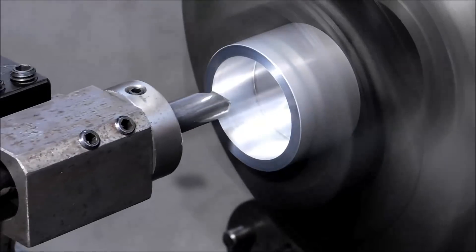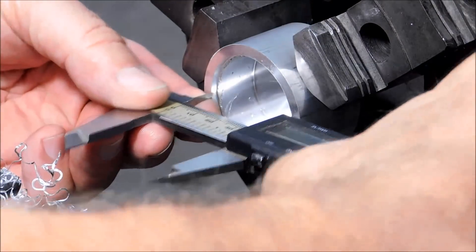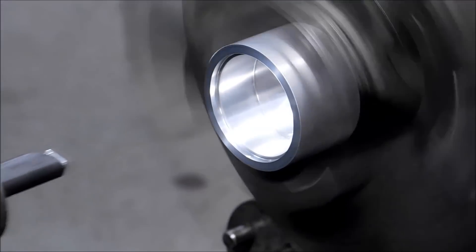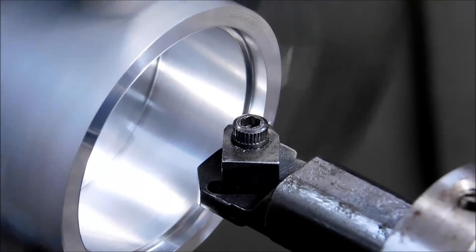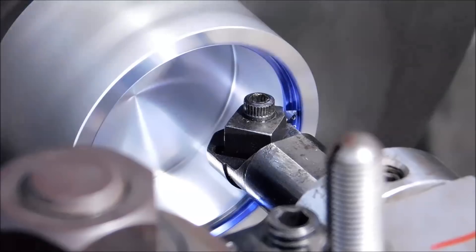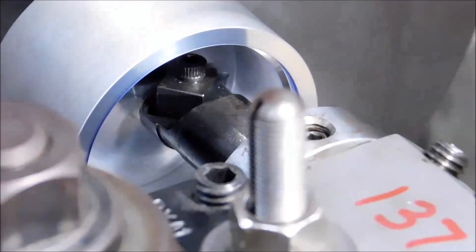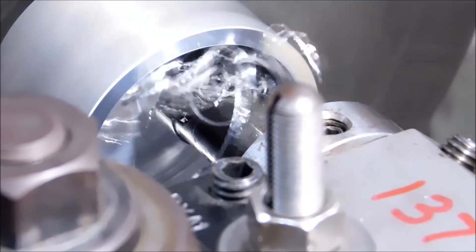I do have to put a small counterbore in the front of this part — just a little bit larger than the diameter of the external thread we just produced. Since that external thread does not have an undercut, we need to make an allowance so the two pieces can screw together. Set up your threading tool, and unless you feel like wearing Dykem on a lathe, make sure it's running slowly. I'll chamfer the lead of the thread with the threading tool so when I go back to deburr, the tool is already set.